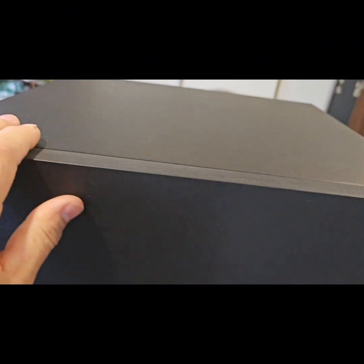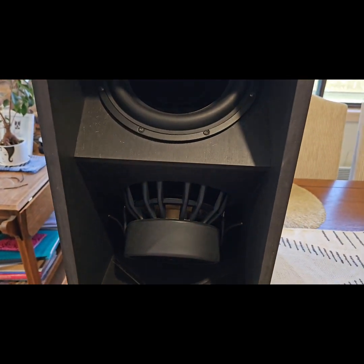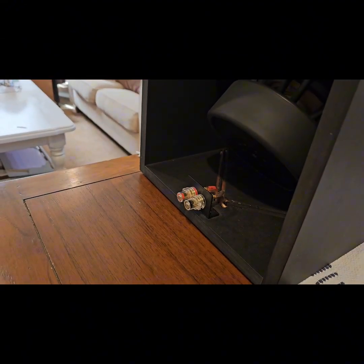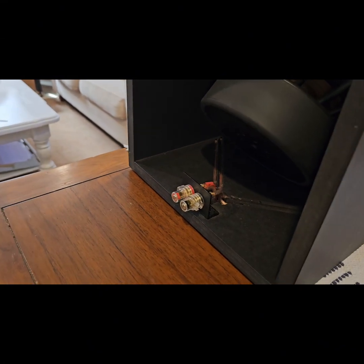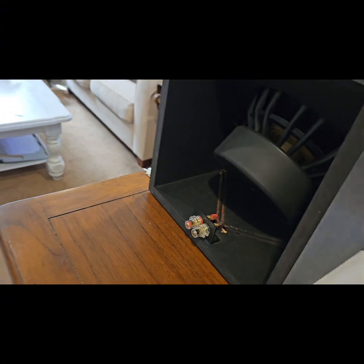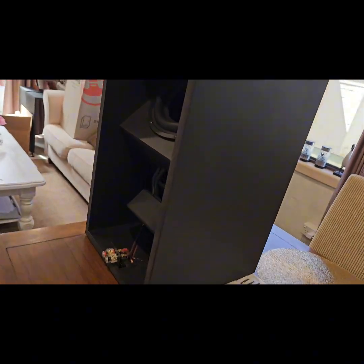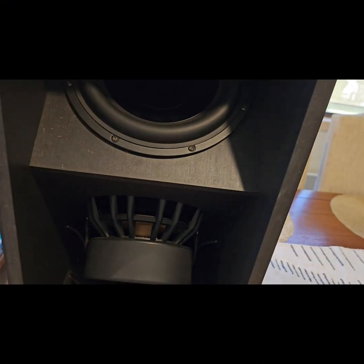It's all pretty square and isn't hard, but there are obviously comprehensive instructions that talk you through each step when building these base units. The binding posts are a modification — I'm not a fan of the Speakon connector, so I preferred to go with a binding post. I fabricated a piece of angle, glued and screwed it to the bottom, then put some binding posts on so we can fit banana plugs into the wiring looms made up especially for this speaker system.